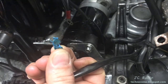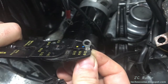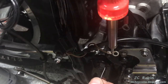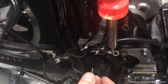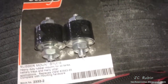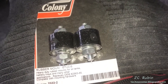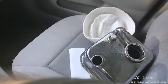We're now going to repair this particular connection — the brown cable that had broken off during disassembly. I'll take out this nut first and remove the old connector. I'll size this connector up for replacement. I know my own strength — as it's a ground, I'll try it without the plastic. I'm going to throw some solder through this after I crimp it. Once it gets hot enough it wicks in — that'll hold. Also, two more rubber mount studs arrived to repair the ones that broke, so those will go in later as part of the reinstallation.